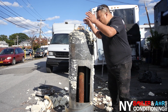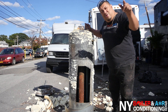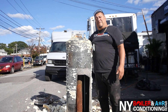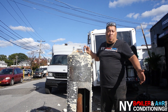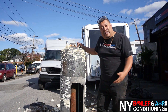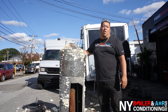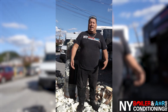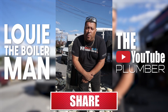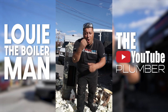Now you get to look at what a gas hot water heater looks like internally — first hand from Louis the Boilerman himself. Guys, you want to change the anode rod at least every three to five years. It's very important. Most people don't do it and then they wonder why their tanks go bad within a few years. If you have anything you want to say, please hit the bell button, leave a comment below, subscribe to our YouTube channel, or just Google 'Louie the Boilerman.' You can also go to our YouTube channel New York Boiler and Air Condition Repair — we would love to hear from you!